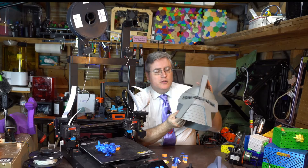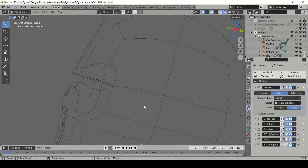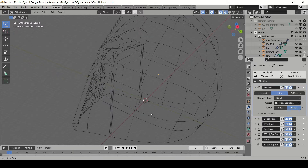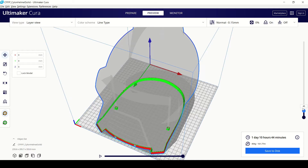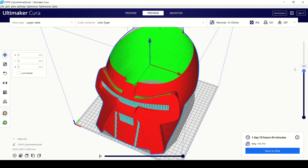There is the question of supports — I can't claim this model didn't have any. These cheeks needed to be supported, and underneath the eyes needed supports too. But internally, where the eye slit came to a point, there was nothing underneath it, and those points were fails. I couldn't do supports on the inside because that's where infill was supposed to hold it up — the infill that this didn't print with. So I added a cylinder or cube-shaped hole from those corners all the way to the build plate, essentially drilling a hole through the model, so it had something to print against and support those points.